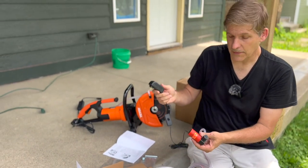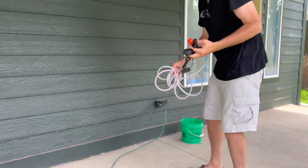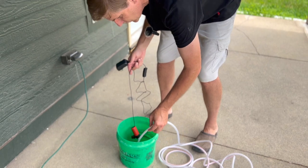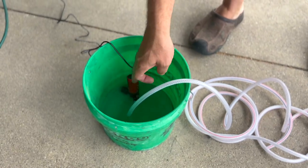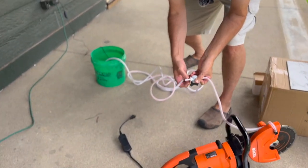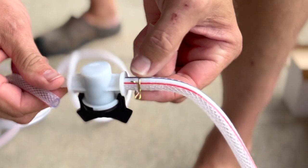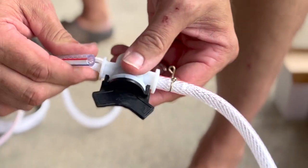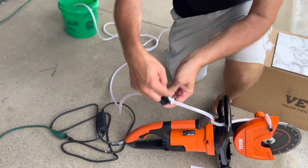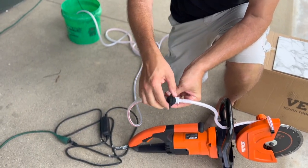Now we're going to plug this in to the outlet — that's an outdoor outlet. Because we're using water, it should be GFCI protected. Don't use an outlet that's not GFCI. We got a bucket of water here, and we'll just go ahead and put the pump into the water. The intake is submerged so it should prime and start. This barb fitting has a barb in the opposite direction — so when I put this hose on, it's going to want to stay on, but you can also use a clamp if you're worried or if it pops off. This is now in an open position where water can come from the bucket through here into the saw. If you turn it this way and just want to cut dry, that stops the flow of water. We'll keep it open.